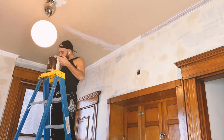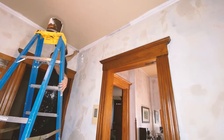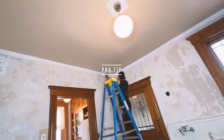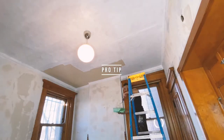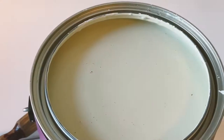It took about four or five layers of thin coats of drywall mud to get the walls as smooth as I wanted them. I then moved on to painting the ceiling — I did not prime it, I simply painted it directly with my white satin trim paint. Pro tip: if you ever have a tin or textured ceiling such as this one, go ahead and just paint it white. It's the best option — it will keep things simple, it will be beautiful, it will be crisp.